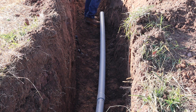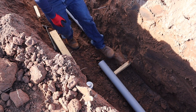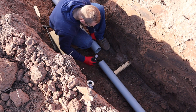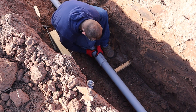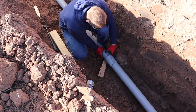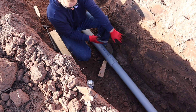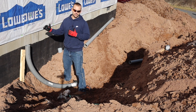Just like any other plumbing pipe, glue it around a few times with enough glue to lubricate the joint. The piece following this one will need to be cut. Again, I had to wedge it over — from above you can see you just put a liberal amount of glue in it, this is regular PVC glue, nothing special. Get around the joint really well, give it a slight twist to water-seal it the best it can, then release. Once that glue sets up it'll be held there for years to come.